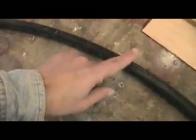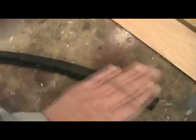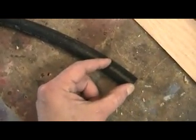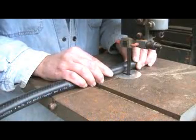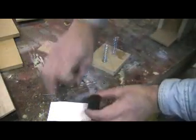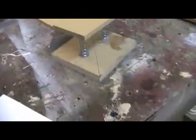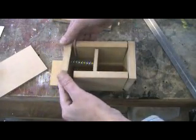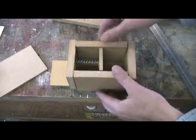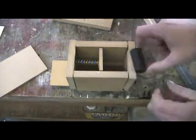While I'm waiting for that epoxy to dry, I thought I could go ahead and cut out the rollers. What I'm going to use for that is a washing machine discharge hose that I picked up at the hardware store for a couple of dollars for a one-foot section. The reason I picked it is because it's got a good grip to it — it feels kind of tacky and rubbery. I'm just going to cut these down to a couple of pieces on the band saw. That's the same size as the pressure plate, just a little bit bigger than a business card. Then the next step is to drill holes where these rollers will go.